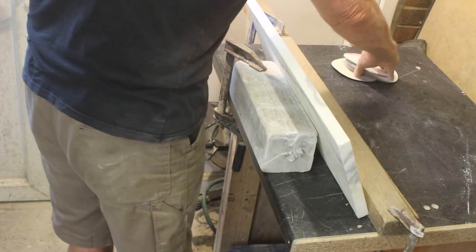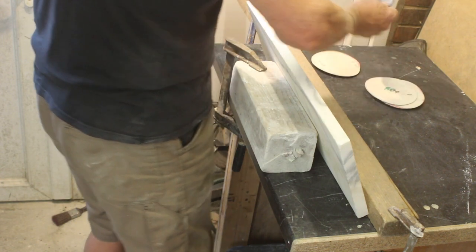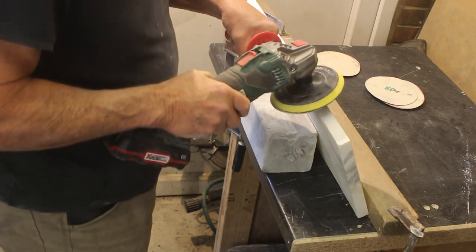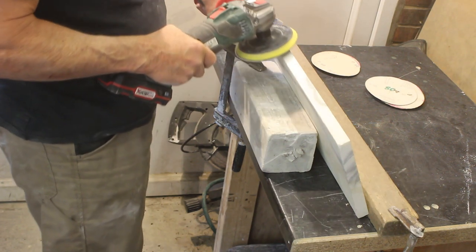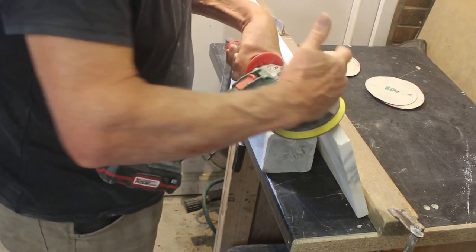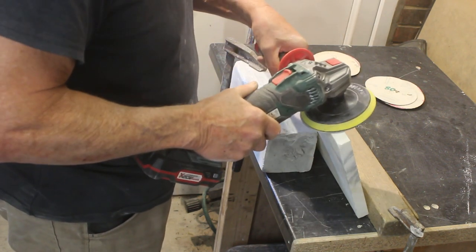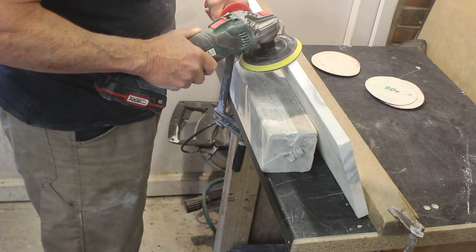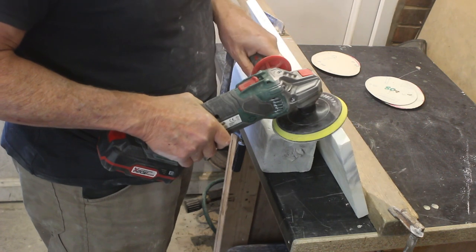The reason for that is that we can now sit at a very natural angle for working like this. It's comfortable — you can brace the back of the tool against your waist and hold the thing really steady and control it. We're going to be aiming to work with the marble across just the top half of the grinding tool. If you try and work it the other way it tends to wobble, so drop it down a bit and aim to have the marble just above center at the top half of the disc.